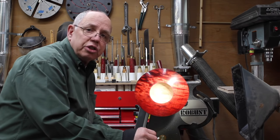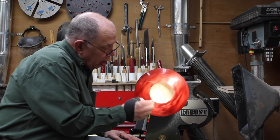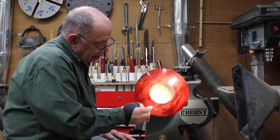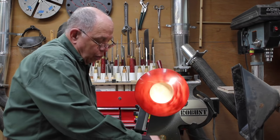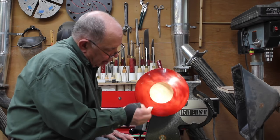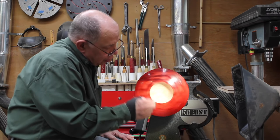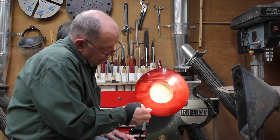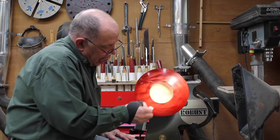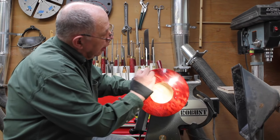I have here my last level of micromesh. I'll go through it so you can see what it looks like if you've never used micromesh — you get a fine powder there. The first time I started using micromesh I dry sanded on my pins, and I found that wet sanding works a lot better. You get a much higher gloss and you don't have the scratches that you do with dry sanding. You can see the difference in the gloss — it's a high gloss finish on here.